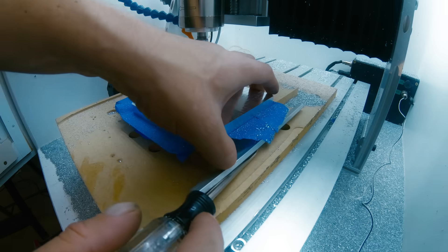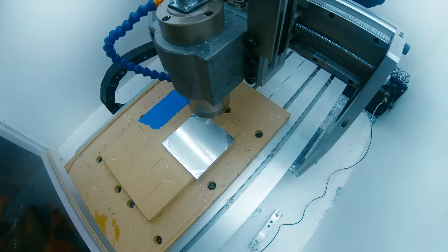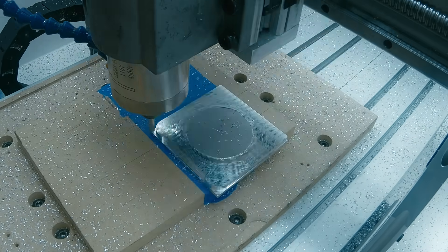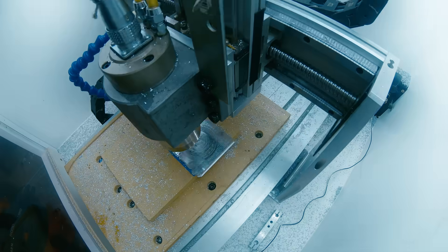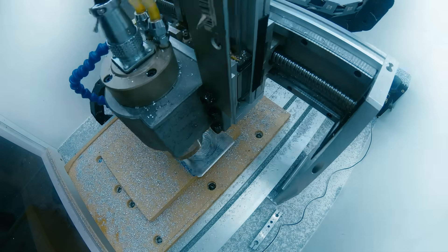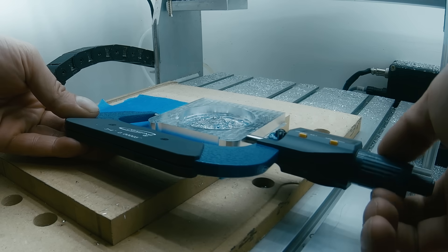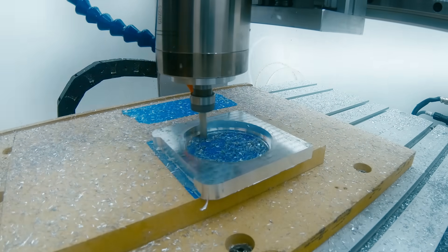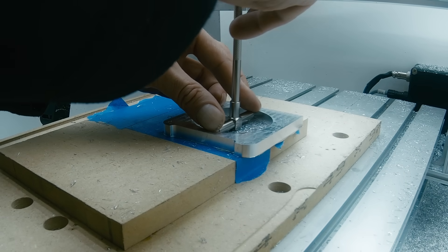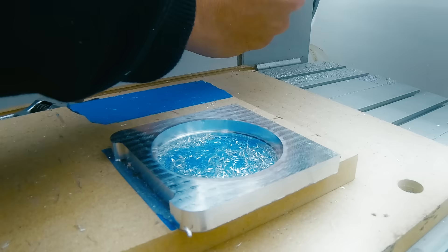I pondered work holding strategy and decided to add a ledge to the spoil board to make removing the parts easier. Real machinists might scoff at using super glue to hold down a part, but it's really effective for machinists on a budget. These hobby machines are perfectly capable of making accurate parts as long as you take it slow and methodically. For any given part, there are a certain number of dimensions that are most critical to its fit and function. In the case of the side plate, one of these critical dimensions is the location and fit of the bore, which meant sneaking up on that dimension, pass by pass, taking very light cuts until I had a perfect fit.